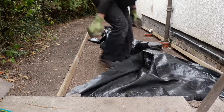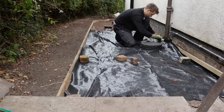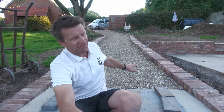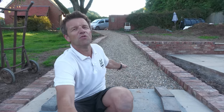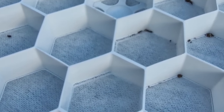You start with the weed matting, which stops weeds coming through and also separates the subgrade soil from the sub-base material, preventing them mixing together. A confession here: when we laid the sub-base for this path I didn't ask my builders to put in a weed-matting layer. At this end of the path we've got around 250–300mm of sub-base, and at the top we're essentially laying on the existing path, so we didn't bother. Time will tell whether that's an issue, but I suspect it won't be. There is also a geotextile membrane underneath the gravel grid mesh itself, which I'll come on to in a minute.